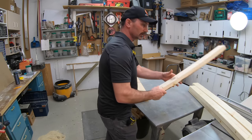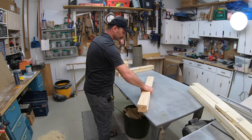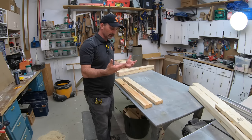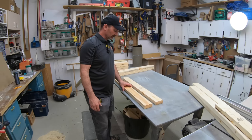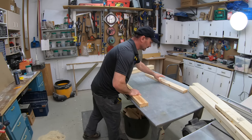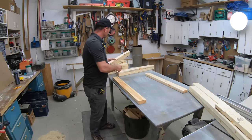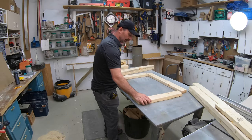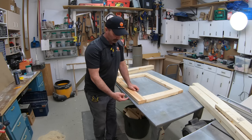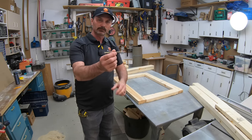I've got left here on the bench just the materials I need for the frames. I'll do the shorter frames first. You want to look your 2x4s over — looking for the face that you want to face out, that looks the best for your finished product. Orientate them so they're the same way when you're putting things together. In my design we're going to end up building the ends, which will be two boxes or two shapes just like that.